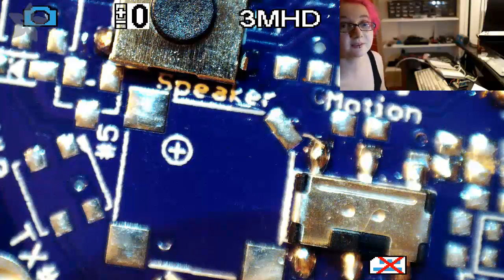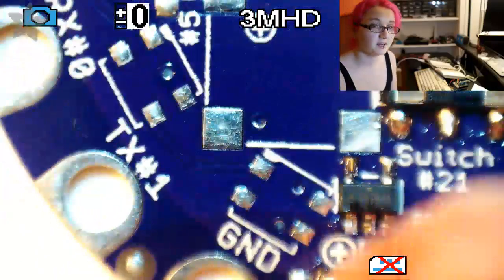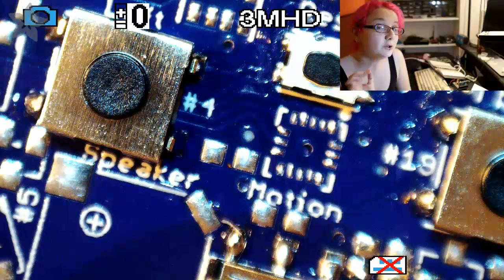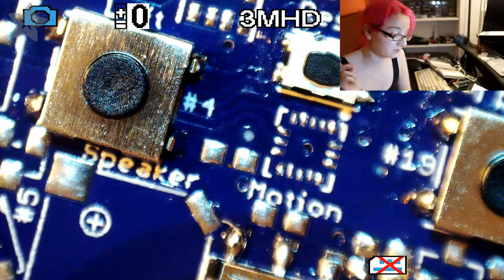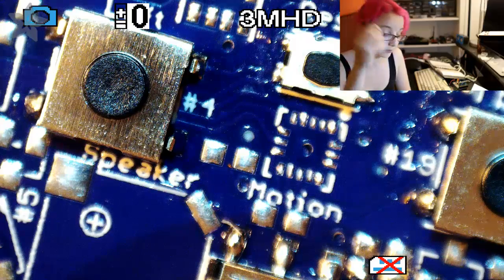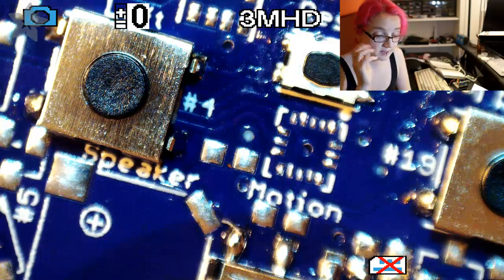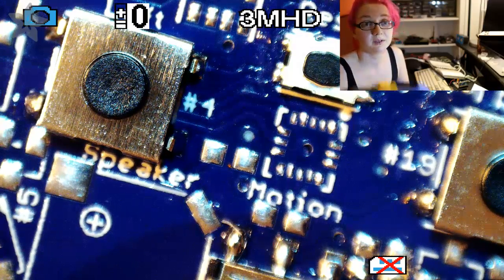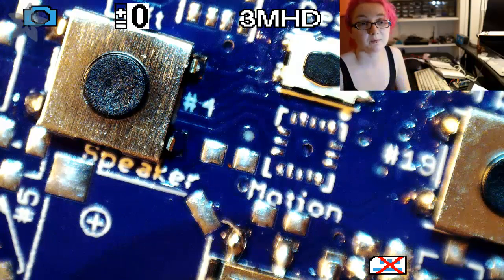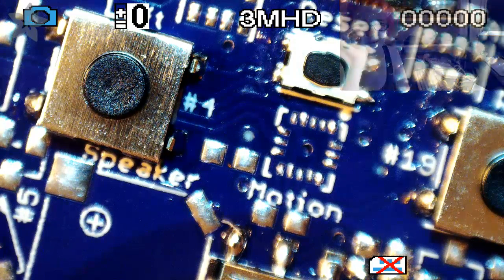I don't know. All right, so what have we proved? First off, it's a nice camera, and we can live stream it. Second, you can totally do QFNs with just plain solder. It's thin solder, but it's plain leaded solder, and a Hakko with a fine tip. You can do it. I don't know the tip number because I don't memorize them, but it's the one we have in the store that's like the micro tip. And yeah, this is a Circuit Playground.